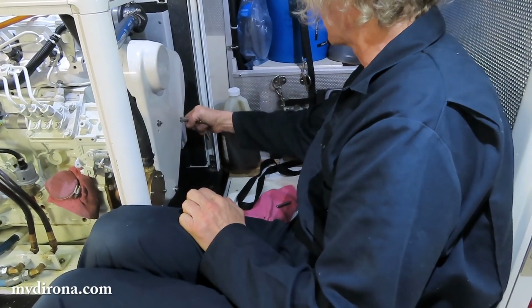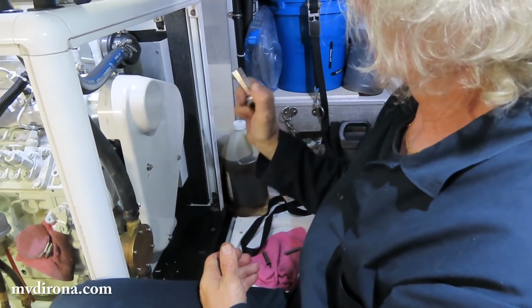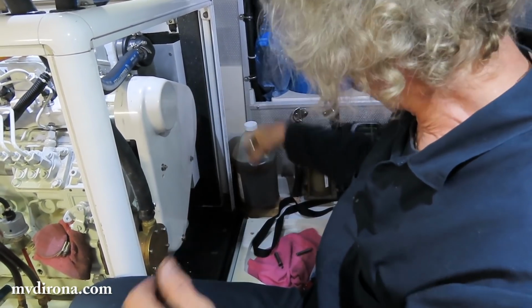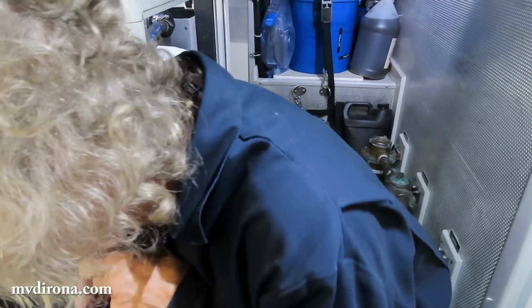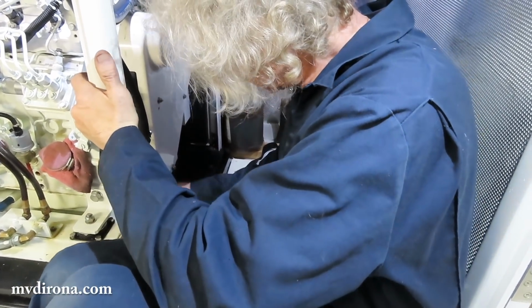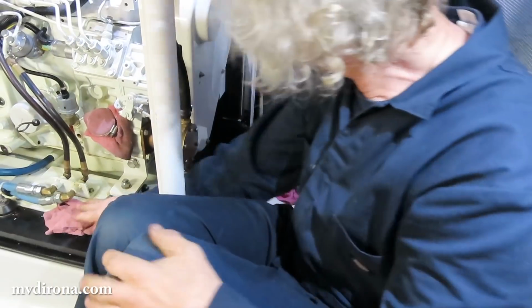I always do the last little bit up by hand just so they're not over torqued. The other thing I do for lighter strength fasteners is I don't hold full leverage, just to make sure I've got good feel for how much pressure is being put on them. Just before putting that front cover on, I'll clear out the little bits of dust and debris. I think that's a surprising little mess really from the job. I mean, little bits of dirt and debris and paint, but not too bad. No, it's not bad at all.